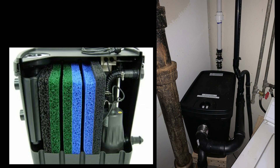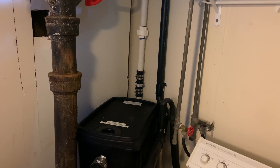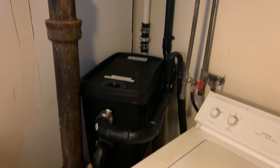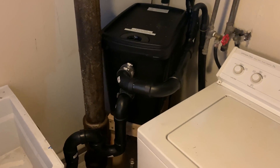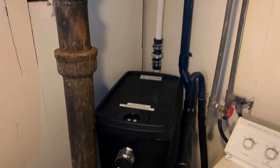This right here is the heart of the whole system. On the left there's a cut view and it looks a lot like a fish tank filter, only for your shower. This is going to filter out all the big particulates like hair. Here is the system in action. I can manually switch between going straight to the sewer or going through the filter and into my storage tanks. You can see a two inch pipe going into the system and then a two inch pipe going into the sewer. If the pump fails it'll overflow into the sewer so I never have to worry about it.